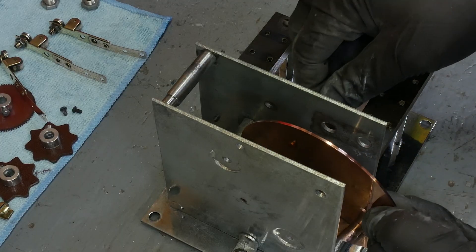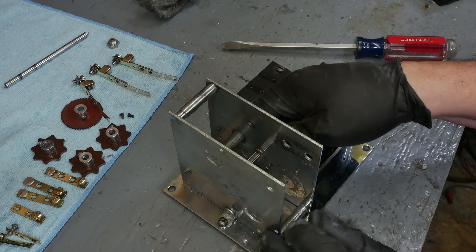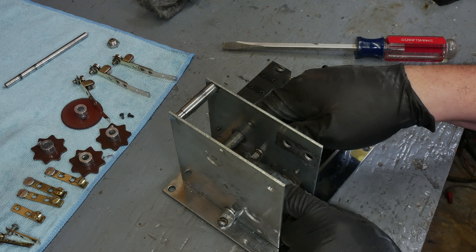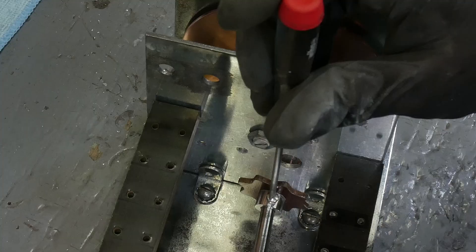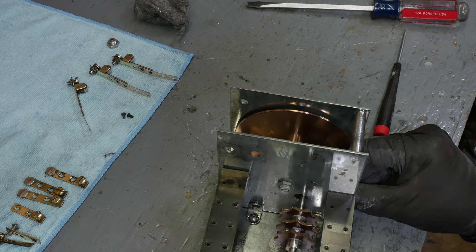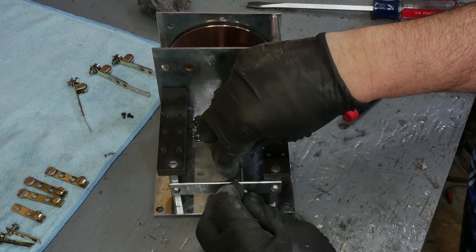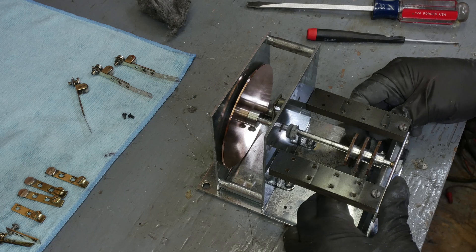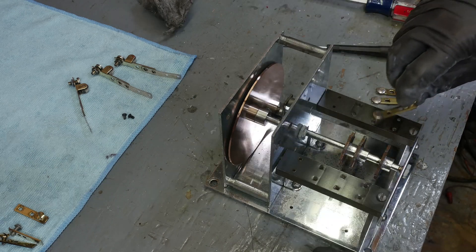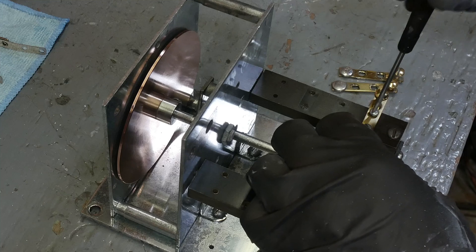For all we know, it might be the last example existing of that piece of equipment, and once it's crushed, it's lost forever — that bothers me. Just yesterday I found out about a ride that's sitting in a field in Arkansas, and since then the wheels have been turning in the back of my brain trying to figure out how I can economically get this ride from Hot Springs to Pennsylvania. This is a Sinitrol Model 30 Type 33 — it's a three-point chaser. You can see by looking at the basic framework how it could easily be modified to a four-point chaser with just the addition of another cam and some contacts.